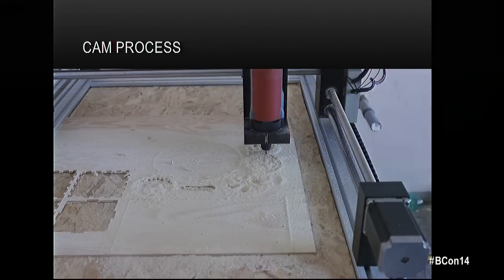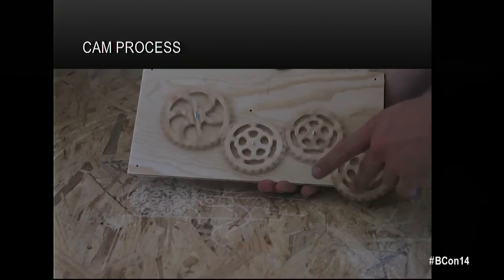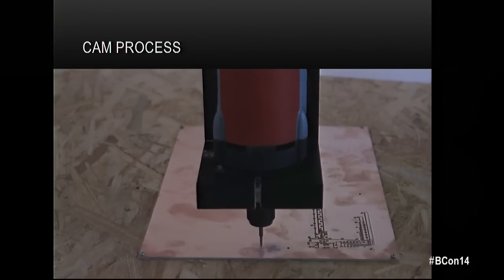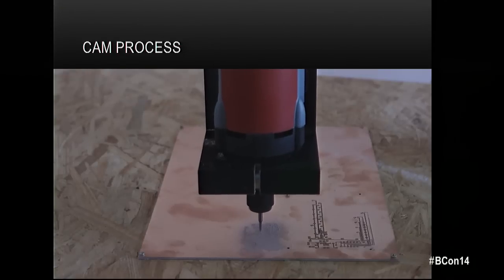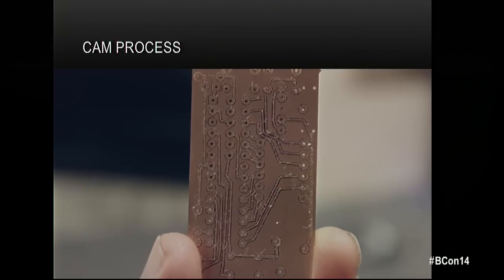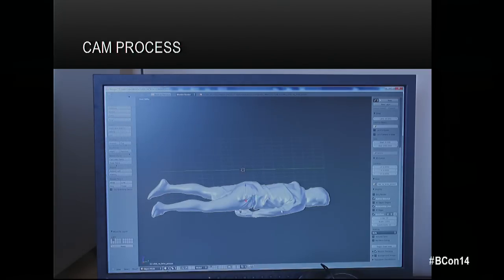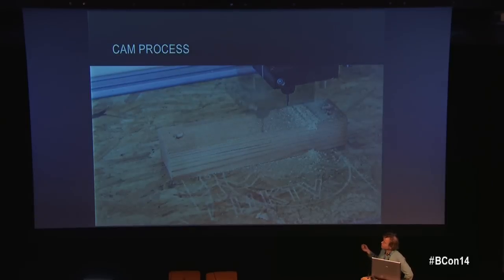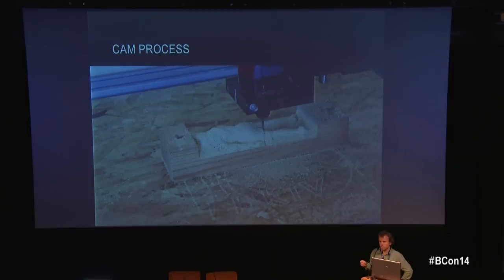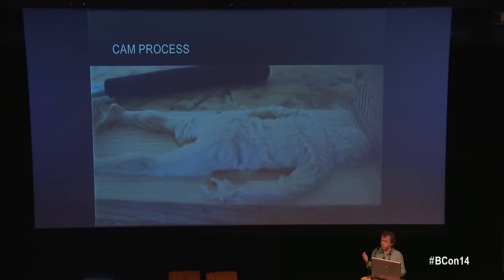The plugin is complex because it has to compute offsets. You have a drill cutting a shape, but you have to offset the path depending on whether it's 2D or 3D cutting. This requires complex collision algorithms, and for meshes with up to several million polygons it becomes a very heavy computational task.